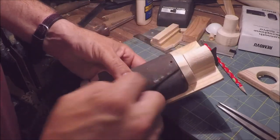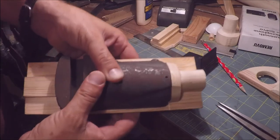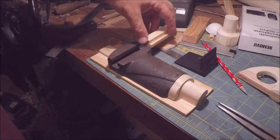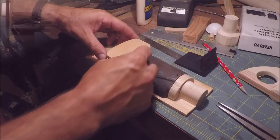Once we get this thing all glued together, we're going to saw all the way around this and along the core print, making sure everything has draft. The next step after assembly is to start working on our core box - that's going to be the next video. Make sure to stick around for the second part where I show you how to build a core box and we'll actually break out some power tools. Go ahead and click on the horizontal mill icon and check out some of the other videos coming up.